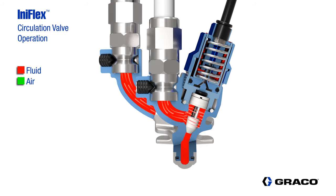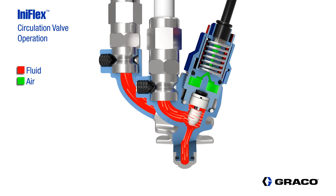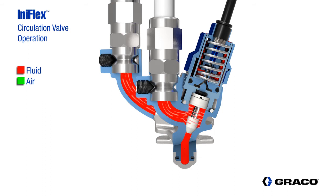The design of the valve has minimal pressure loss and no dead spaces for paint solids to collect in. When the valve is activated, paint will flow to the point of dispense, but will also continue to flow through the circulation loop to maintain suspension in the paint return line.